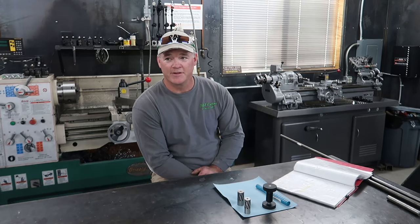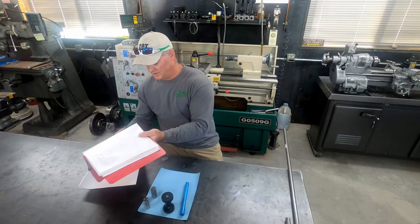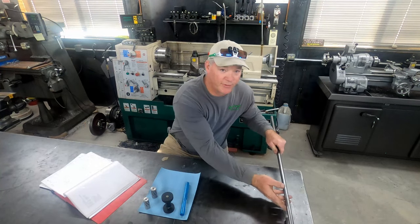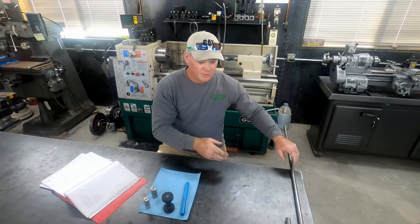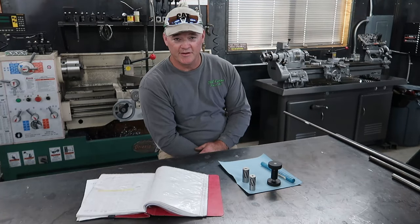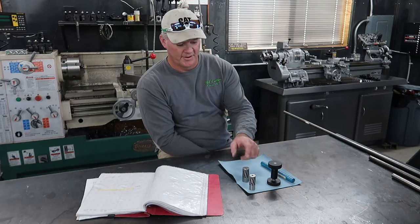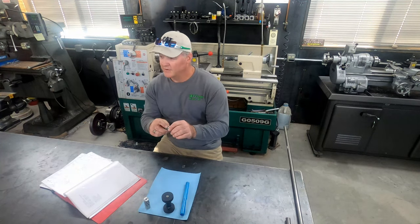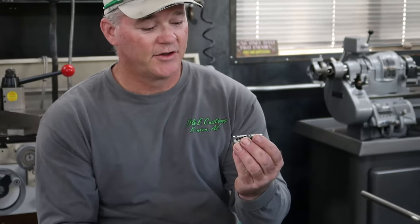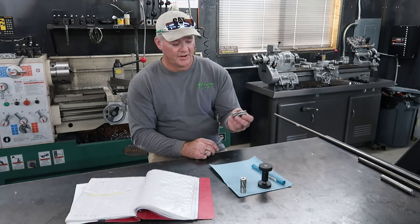You're probably going to see a run of about one, but the way I do it is I make them in batches. I just buy 1045 steel in pieces just like this. I also do stainless steel muzzle brakes. I buy it in chunks and cut them into little pieces — I think they're about two and an eighth inch long. Then I'll go ahead and bore and thread so it'll thread onto a barrel — I'll do that on my lathe. I pre-drill a quarter-inch hole, and as it goes on the gun, whatever caliber it needs to be, I'll drill that out to suit. So these are universal — they'll go on any gun.